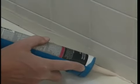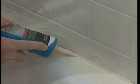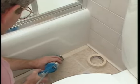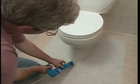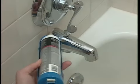We also caulk between the wall and tub, between the floor and tub, between the floor and the wall, between the toilet and the floor, and around the spout and valves.